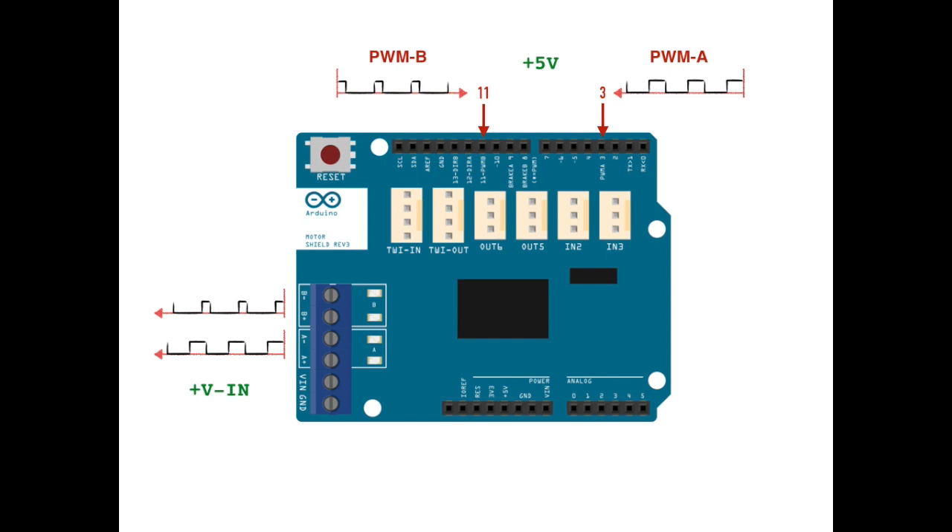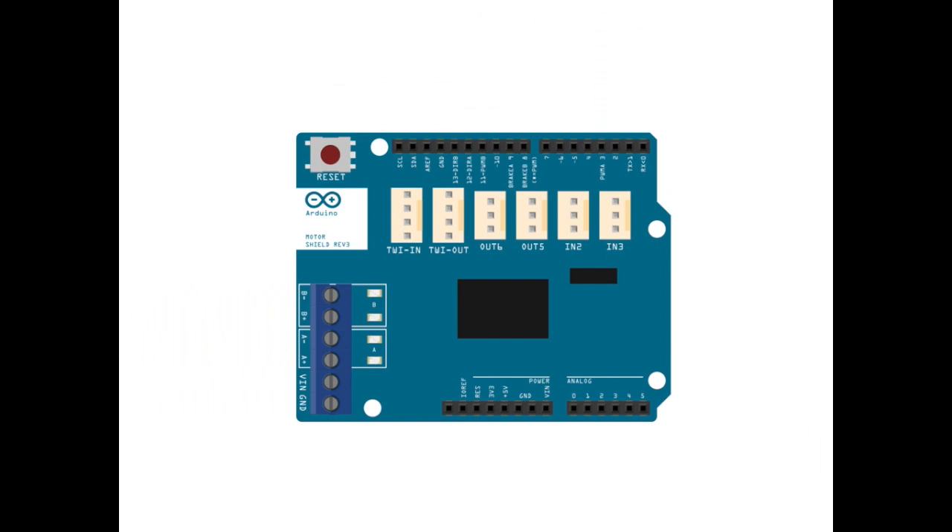And all that's very nifty, but totally useless for our purposes. We don't need to directly control motors and we don't want to toggle the voltage to the train tracks on and off. We need the tracks to be powered on at all times so the DCC decoders can operate and they, in turn, will control the train motors.